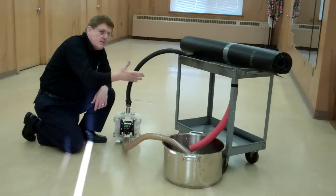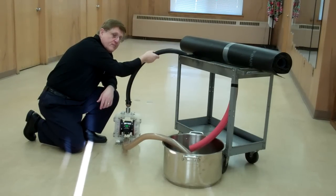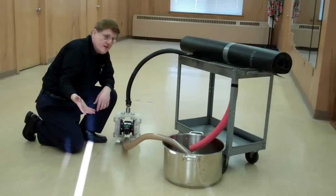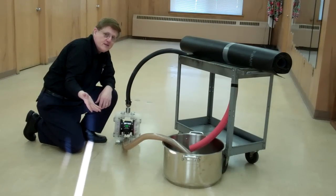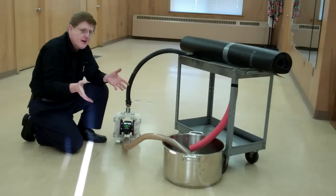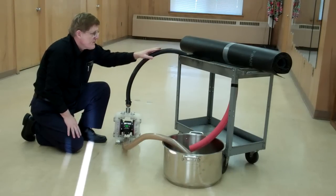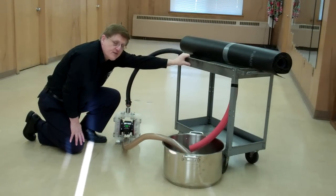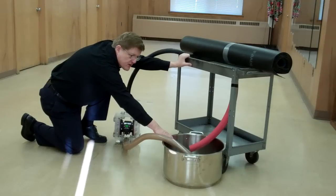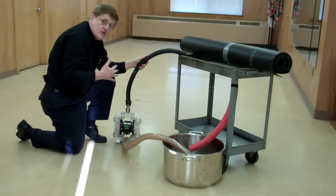The in-line viscometer evolved from a number of ink suppliers to go in the ink line for flexographic printing. Now a lot of you in the gravure world are asking why you can't use that — and you can, but you have to realize it was made for a different application. The ink is almost the same, but the application differences are the flow rates, the cleaning, and the changing out after the job is done. That's where you have to decide whether to measure in-tank or in-line and deal with cleaning the line.